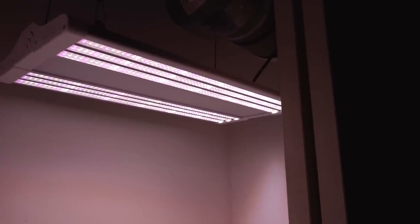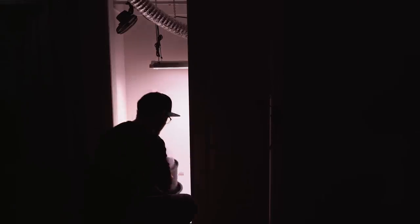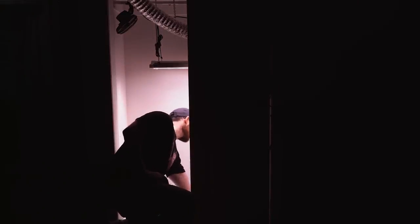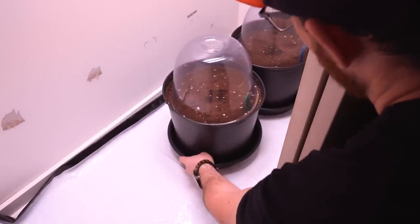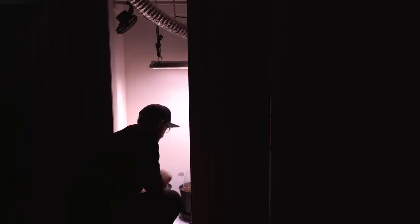If you're using high-end LEDs, 35 watts per square foot is required to light the space sufficiently. If you're using older LEDs or running older bulbs like an HPS, it's recommended to use around 50 watts per square foot. This closet is just shy of a full 3x2, making it around five square feet total, so I need about 180 watts — which means the ES 180 V2 is going to work out perfectly.